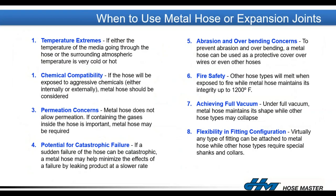The next slide covers when to use our product — essentially when nothing else will work. If a rubber, plastic, or composite hose will do the job, use those products. However, the first major reason to use metal hose is temperature extremes. If the media or surrounding environment is extremely hot or extremely cold, metal hose is the only option. Metals get softer as temperatures increase, so temperature derating factors must be applied to obtain the derated working pressure.